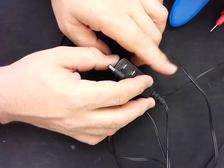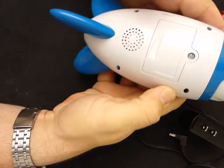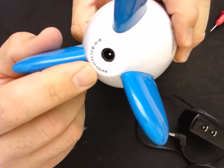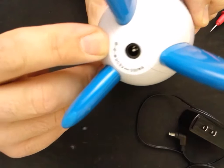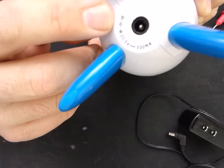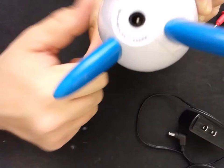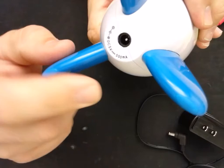Before we get into the details of what's inside, let's do a quick rundown of the outside. We've got a speaker hole, probably a battery container on the back, and some type of external power adapter port in the back. Most good companies are going to list what type of power adapter you need. This symbol here has a negative inside a circle going to the outside ring, then a center dot, and then a positive. This is called center positive, meaning the plug should put positive voltage in the center and ground on the outside.